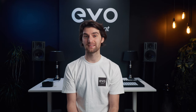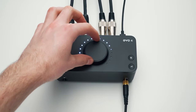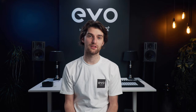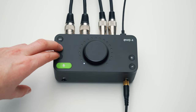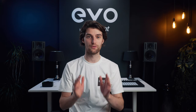Of course you can still manually set the input levels if you'd like — just press the channel number and then adjust the volume knob to set the gain as you wish. If you're using a stereo source, such as recording a stereo instrument or a stereo synth, you can join the channels together to adjust the gain in one go. Just hold down one channel and then press the second one, and now they're linked — both channels will move at the same time.